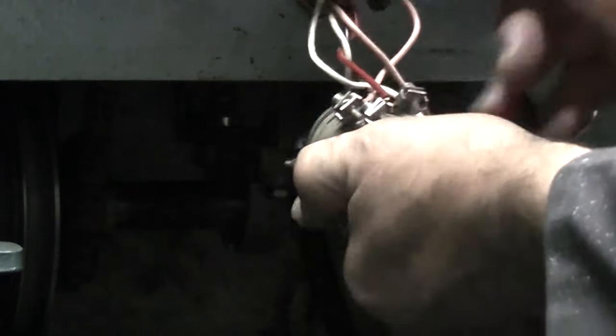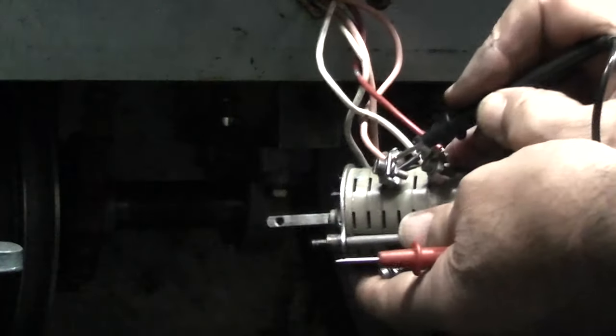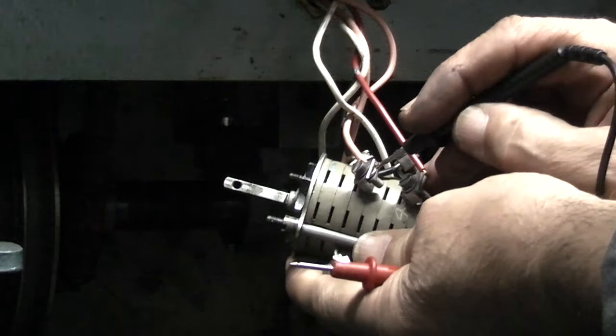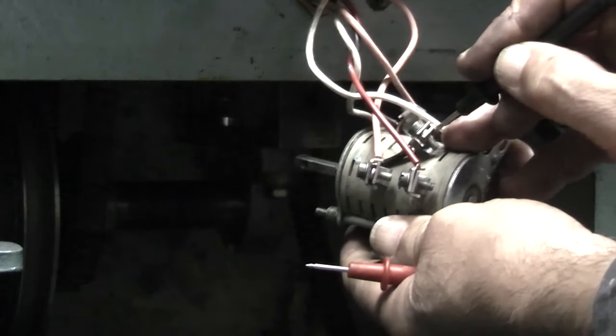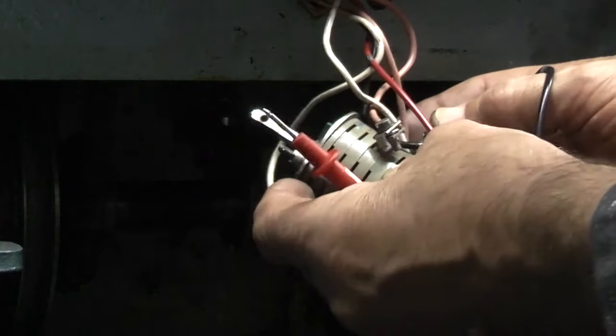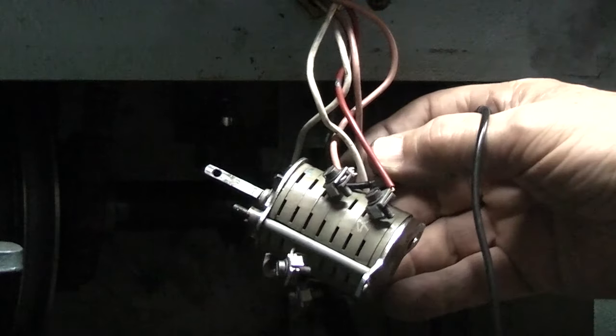and the other pink wire is connected to third layer down, which has number 2, and this one which is not numbered. So I'll just hold it on there, and that is the other pink wire from the other coil, which also has a wire connecting it to number 6. So one pink wire goes to number 5, the other goes to 6 with a connection to the terminal here, which is not numbered, which is 3 layers above terminal 4.